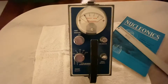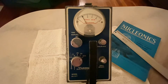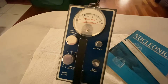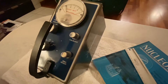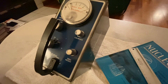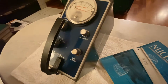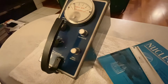A quick history: these were used for uranium prospecting back in the uranium boom era, around 1954–1955. They were a lot more sensitive than Geiger counters because they use scintillation-based detector technology, which is considerably more sensitive than a regular Geiger counter. These old units typically use 67.5-volt batteries as well as 22.5-volt photo flash type batteries, and a couple of D-cells for the filaments, because these are tube-based electronics — they don't have any transistors in them.